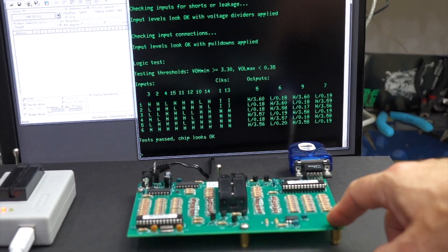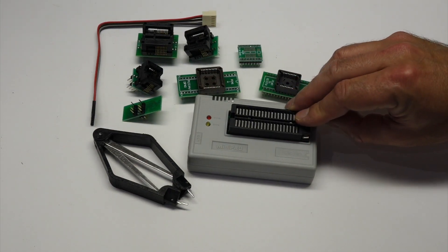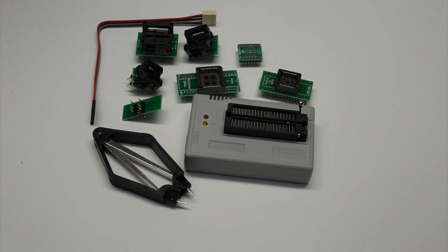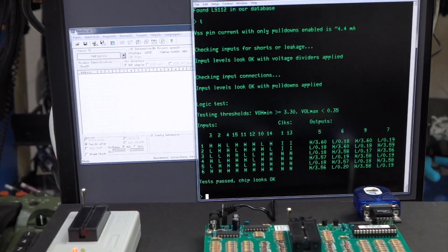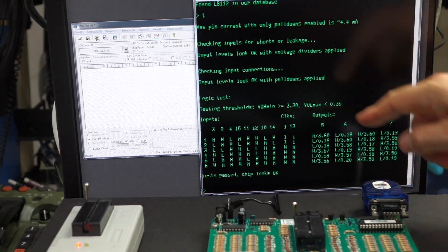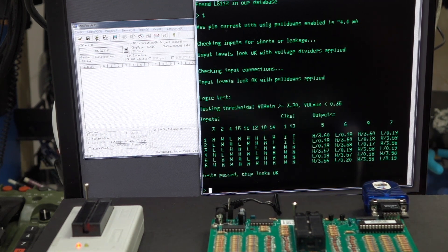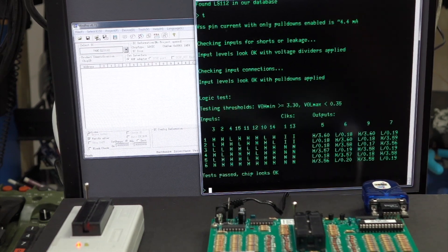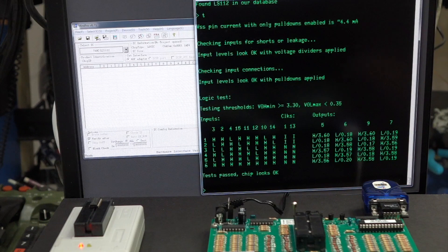All right, time to test. Here I have the Tauntek, and here I have my TL866, which I didn't know could test logic IC circuits. It's a great unit — I use it to program EEPROM — but yes, it can also test some TTLs. Thanks to the commenters who pointed me to that. We're going to test a bunch of failed chips from the 9825 restoration and see how the two compare. So for added fun, we will compare these two testers side by side: the TL866 EEPROM programmer and the Tauntek I just built.